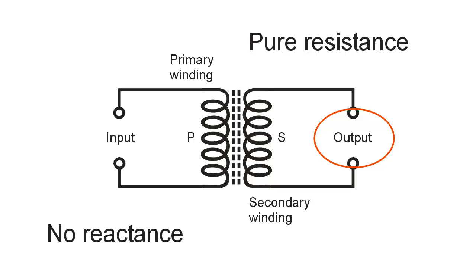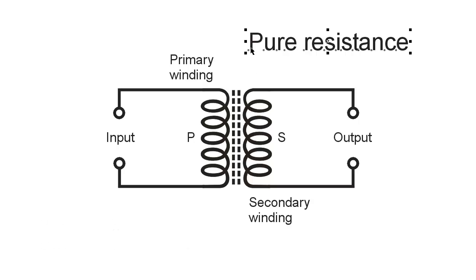The input might be a microphone, the output of an audio amplifier, a transducer like an ultrasonic transducer, or even a loop antenna if you intend to listen to baseband audio electromagnetic signals. The output might be a speaker, headphones, a device of some kind, or a sensitive pre-amplifier. You mustn't have any reactance in the input or output for this discussion to be valid.